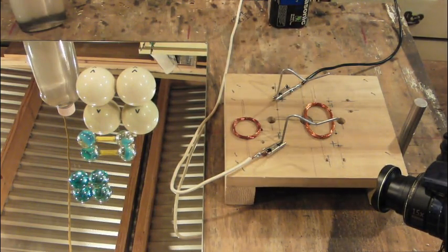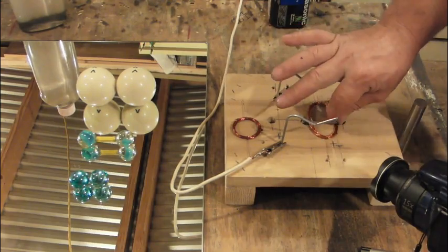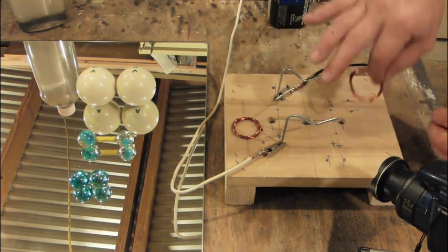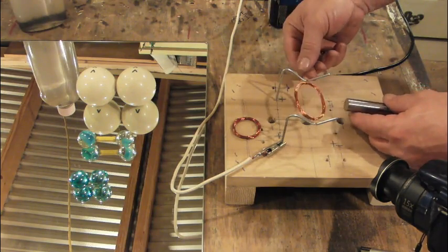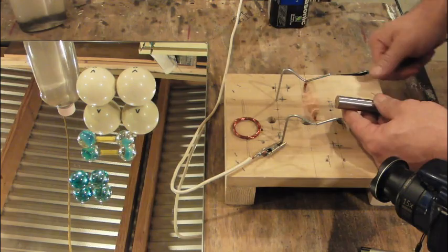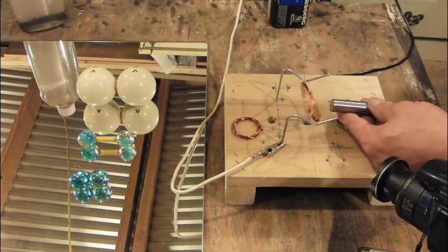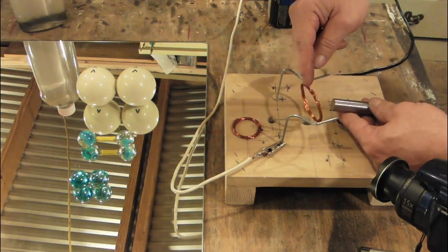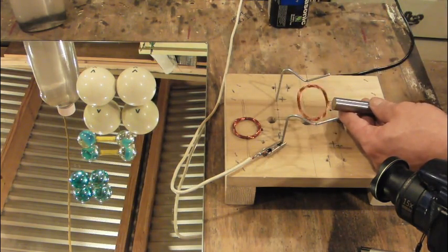These same right-hand rules of deflection should show up when we move anything. The basics of this electric motor is, if I take this electric motor and spin it with a magnet in front of it, this also pulls an electric current, and it will produce electricity through those wires. Just the movement of that copper in front of that magnet will produce an electric current.